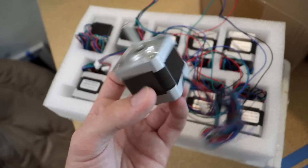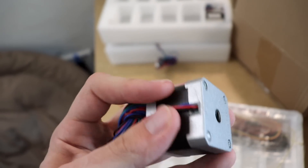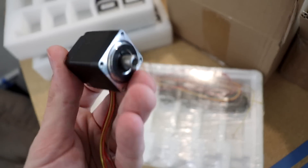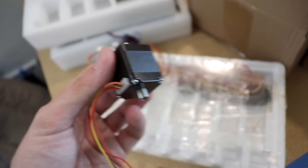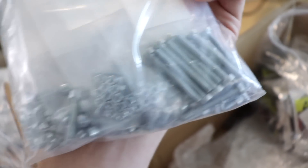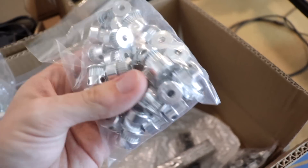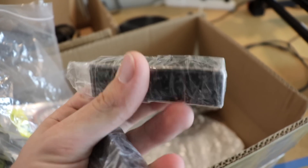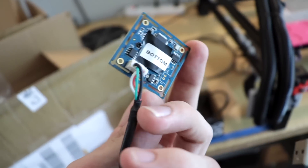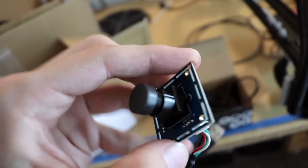After a ton of printing I have enough parts for three machines. And of course we have all the parts that Lucia has been sourcing over the past month. Here's a whole bunch of stepper motors that we got as a sample from a vendor — these will act as both the X, Y, and Z motors. These steppers currently come with wires already attached inside the motor, but we're working with the vendor to get a connector so we can plug our own custom cable harnesses into them. We also got a whole bunch of rotation stepper motors — these are the ones that mount on the head and rotate the nozzle so you can get the part in the right orientation. Lucia also got all of the hardware in the entire machine pre-bagged into kits: all of the M5 35mm screws, all the M5 nuts, all kitted out and labeled. Along with a whole bag full of limit switches — the classic MakerBot style — plus all the GT2 timing belt pulleys and idlers, right angle brackets, and cameras labeled as top and bottom camera so when you plug them in they enumerate as the OpenPNP bottom camera. And a lot of GT2 timing belt.